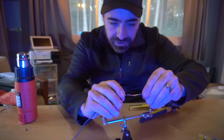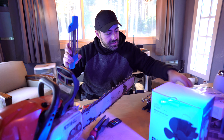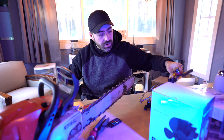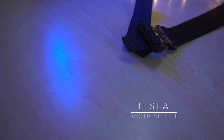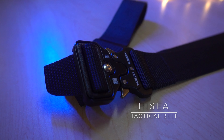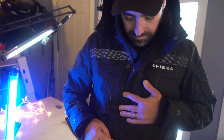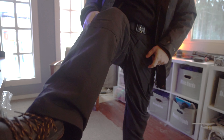After cooling down, I'm pulling on this as hard as I can and it will not come off. That is a nice watertight, perfect connection. The solder has permanently connected the two wires together, and the outside edge is tight against the insulation — no water is getting in there. It's a watertight, secure connection, way better than a standard butt connector without solder.